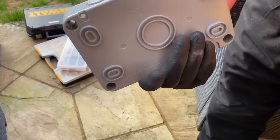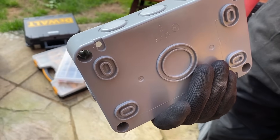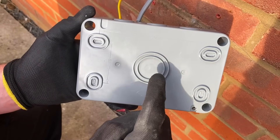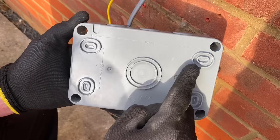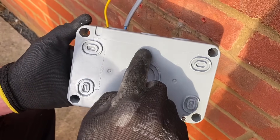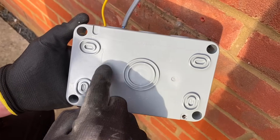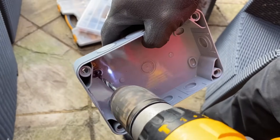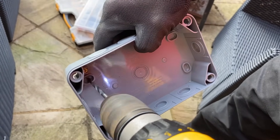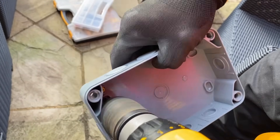I drill out the drain-off point using a five-millimetre high-speed steel drill bit. Once the hole is drilled, it's important that when you fit it to the wall you get that drain-off point on the bottom side. On the back of the new socket I'll drill the hole in the correct position — in the center — and fill that area with silicon, as well as the four fixing holes. There's a handy little measuring chart to make sure you get those fixings in the correct position.